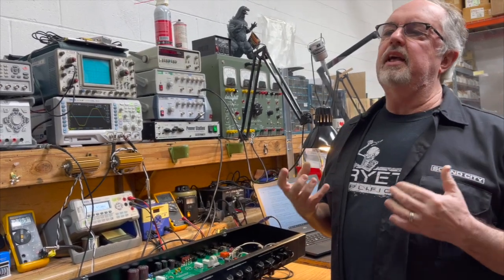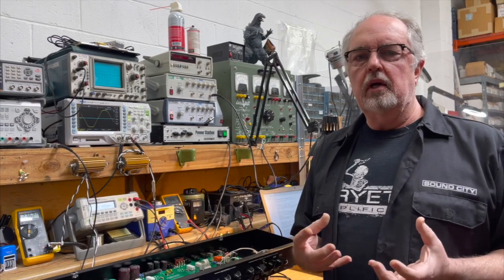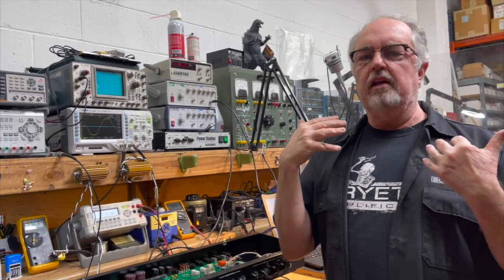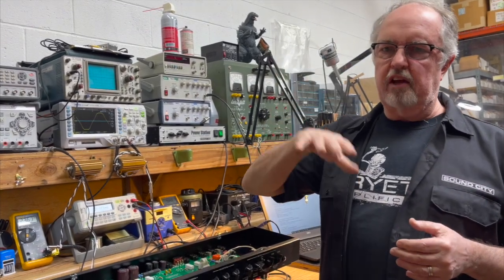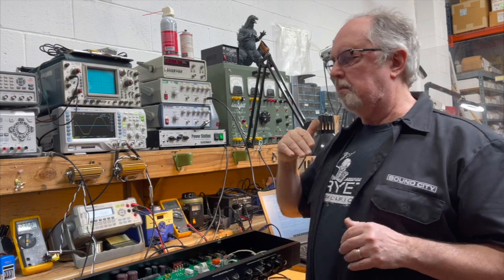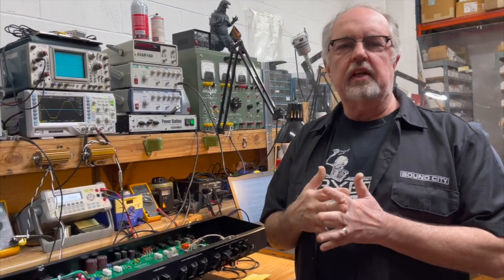Why don't we just put the amp on an attenuator and clip the crap out of it? We can. What that will do is cause the output transformer to saturate more and induce more of that sort of mid-range bark that output transformers impart on the sound when they begin to saturate. They get more mid-range heavy because when they're saturating, the high and low frequencies roll off. So you get more of a bark in the mids by doing that. The reverse smile EQ. Why didn't they do that? You probably didn't because attenuators of the day sounded like shit.